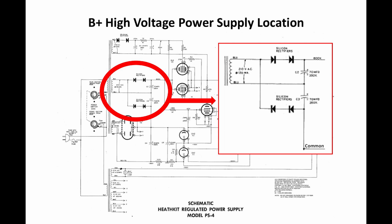And the predominant failure mode of a diode is shorted. So we don't want to cook anything, so by having 2, presumably we're safe. And so that's what they were doing there. Now, as you look at the capacitors, I did some testing on them, and they're kind of interesting.